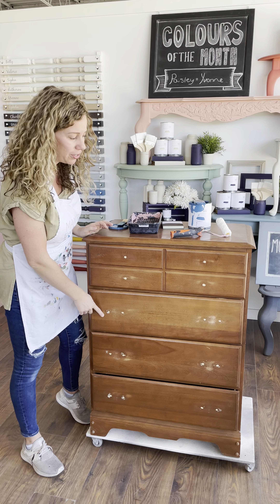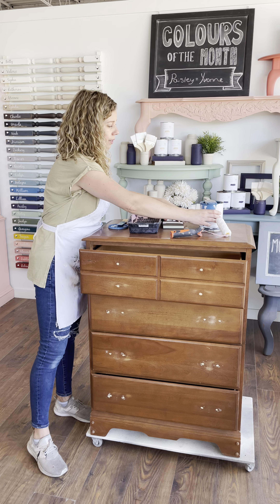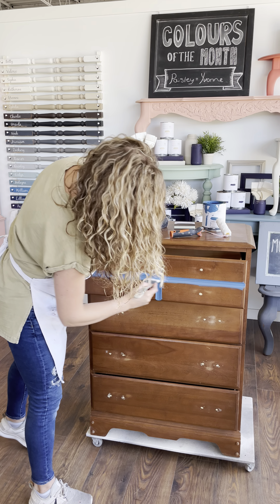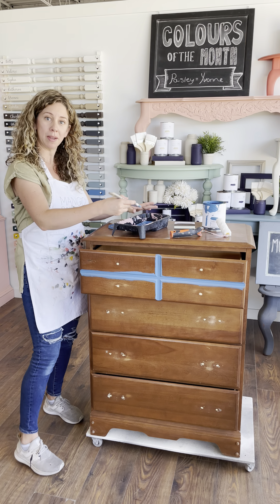This drawer has the most detail — the others are nice and flat but they have a little border, and this one has sort of a cross border. So I'm going to use my brush to get paint in and through those details, and then use my roller to smooth it out overall. I get paint on my brush just halfway up, and use the offloading area to get any excess off so I'm not gooping paint everywhere. I put my brush on an angle to get right into those details — I'm not worried too much at this moment about it looking pretty, I just want to get the paint on and move it around.